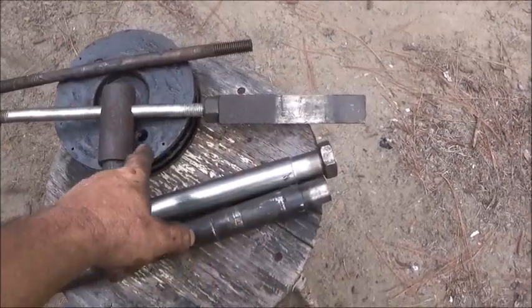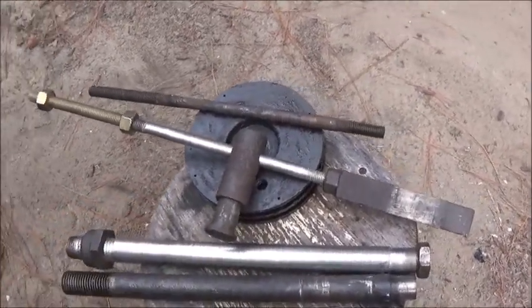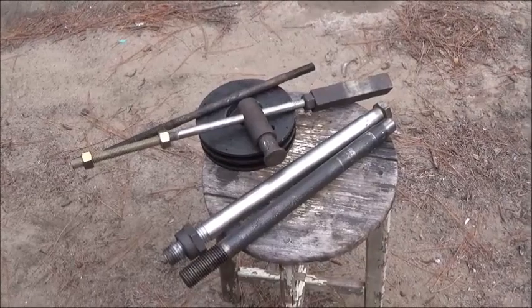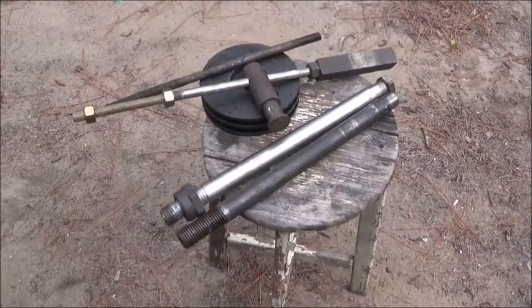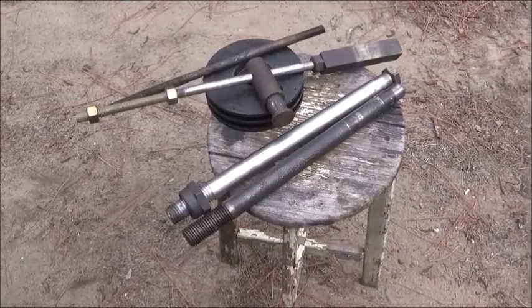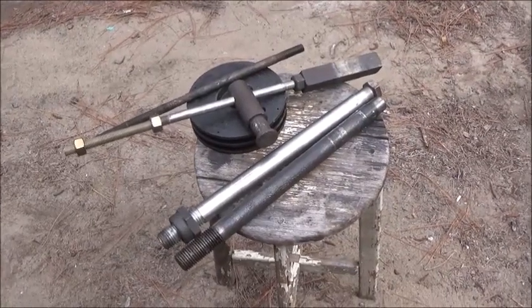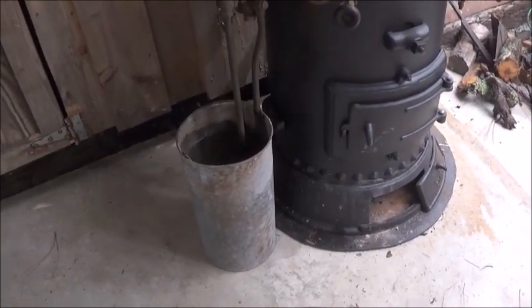One inch eight threading is done, so we've got to heat this because it's a sweat fit. If I was a single man — or if I wanted to become one — I'd do that in the oven in the house, but I don't think I will. Rings will be here tomorrow. I've also got to machine the surface for the slide valve. Now we're not restoring this like you see some other people do, where they completely redo everything. We're repairing it. This thing has lasted 100 years — we're just going to get it together where we can run it, and let it last another 100. They're very well built.